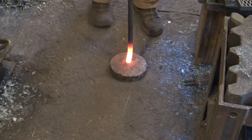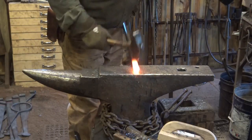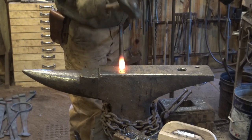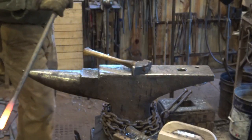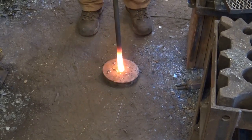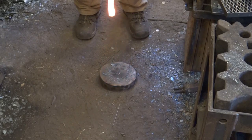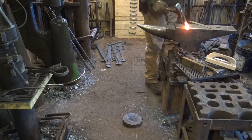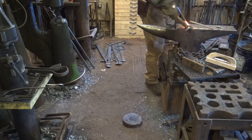You can see the end is starting to bend, so I need to take it to the anvil and straighten it. I'm just going to straighten that out and work the end back so it doesn't mushroom too badly. Then go back to upsetting — it's just a back and forth procedure. A shorter heat would probably be a little bit better for this. If you let it get too bent and twisted, you'll never get it straightened, so stop and straighten it again. You just go back and forth as often as you need to until it's the size you want it to be.